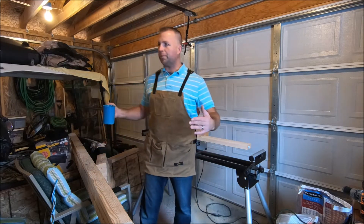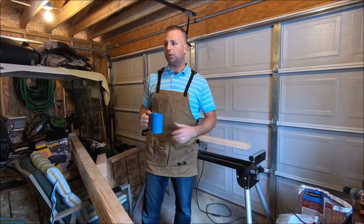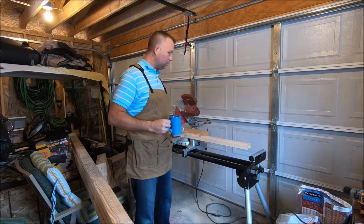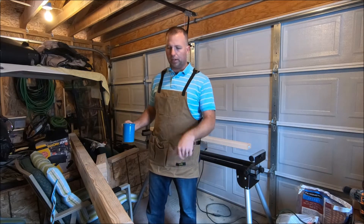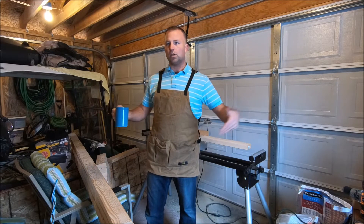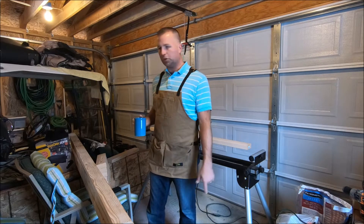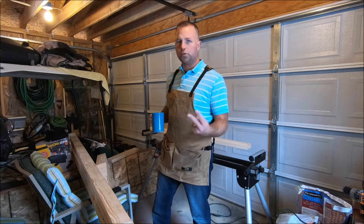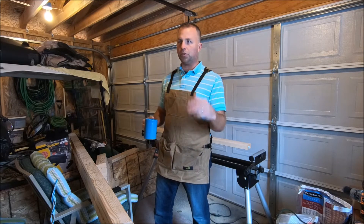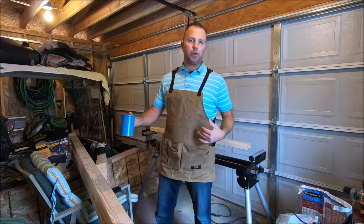Right now I'm cutting the pieces up. Her section happens to be 12 foot long, we already measured it out, and 2 foot deep is what we're going to do — the shelving so the totes fit right on it. What I've got to cut is all 21 inch pieces for the middle of the shelves that come front to back, and then the 12 foot sections for the sides. I bought 6 twelve-foot pieces so I don't need to cut those at all, which are 2x4x12s. And then I got some 2x4x8s that we're going to cut down to 21 inches, and then we're going to cut two 20 inch ones because those are going to be our spacers for the shelves — so that's exactly the height. I'll leave the dimensions in the link below, but everybody's will vary. The 2 foot out is probably the way to go as far as shelving because the totes fit perfect on that.